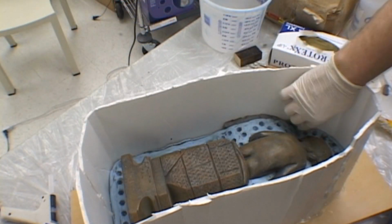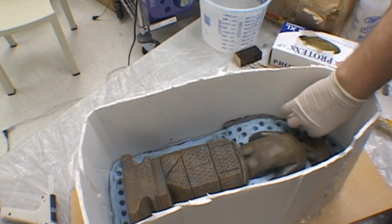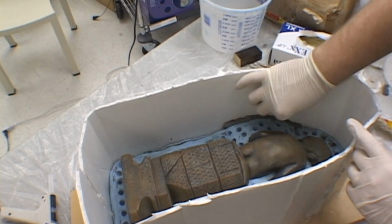After we have sealed down the mold box, it is then time to make sure that there is no leakage between the first half of the rubber mold and the edge of the mold box. This is done by using the soft oil clay again to fill in the gap. Work your way around the entire model to make sure that it is well sealed.